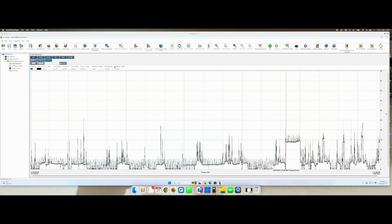You can see in this window of nine days the maximum demand is 26.22 amps. Normal usage throughout the week, and then he started putting his hot tub on from cold around the fifth or sixth day. It hovered and just tickled away nicely. You can see the house basically on top of that hot water usage. That gives you a lot of confidence that we are nowhere near that 80-amp fuse. That's the hot tub heating up — a massive spike — then just tickling away keeping warm, and then it's turned off. Really good data, and confident we can put our heat pump in.